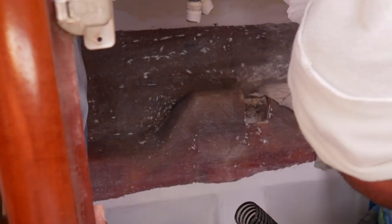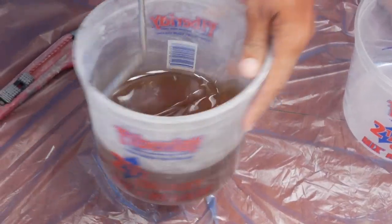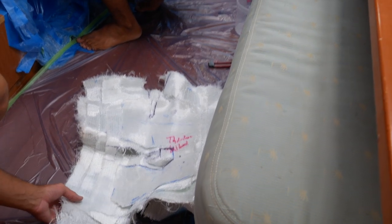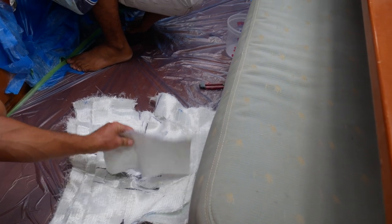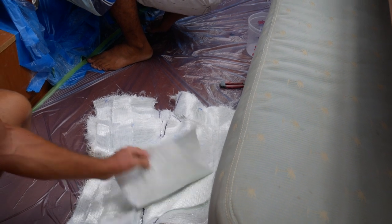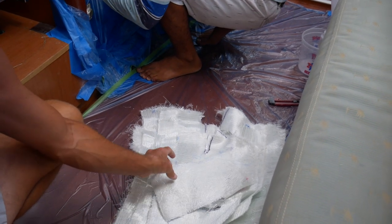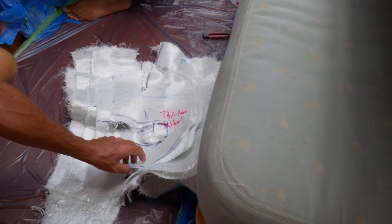This week, as fiberglass works continue on Zephyr, all hands are on deck as we get Zephyr ready for the Atlantic crossing. So what he's going to do here is add 6 layers on top of what he's already done, starting with the smallest layer and building out. So we've got 1, 2, 3, 4, 5, 6, and they progressively get bigger. Yeah, that's the plan. Those are the 6 layers there.